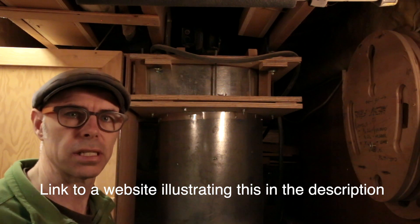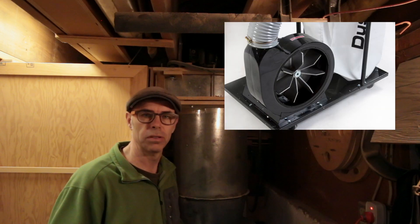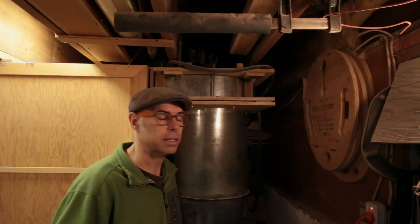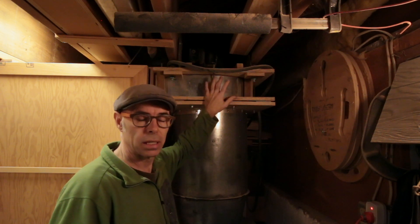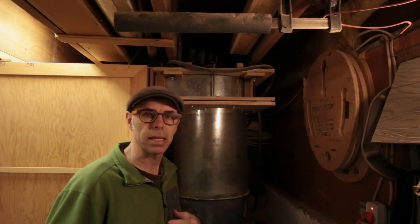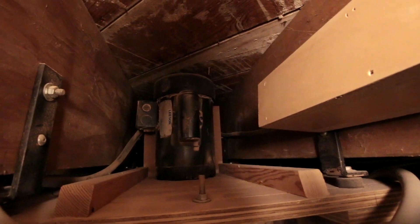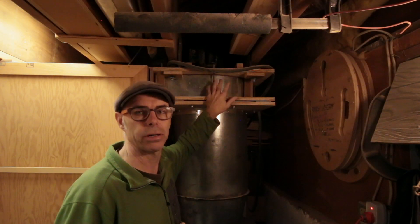Inside is a highly efficient airfoil impeller, which is a little different from typical dust collection systems. Typical systems have a material movement impeller — basically a steel paddle wheel with flat or slightly bent blades, which is pretty inefficient. Up here I've got an airfoil impeller with a lot more blades and each blade has an airfoil shape to it. That means I can use a smaller motor to get higher efficiency. I've got a 2 horsepower motor, but it's delivering the same efficiency as a 5 horsepower motor with a material movement impeller.